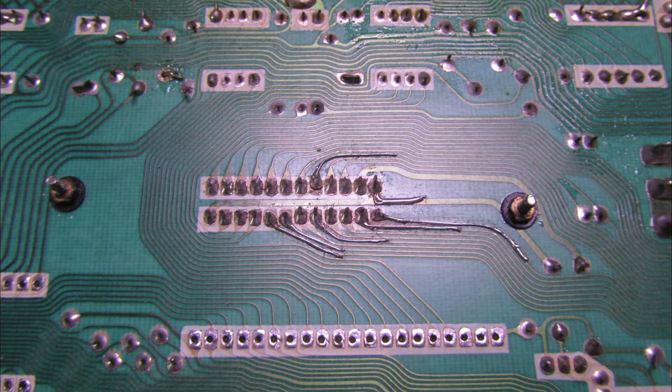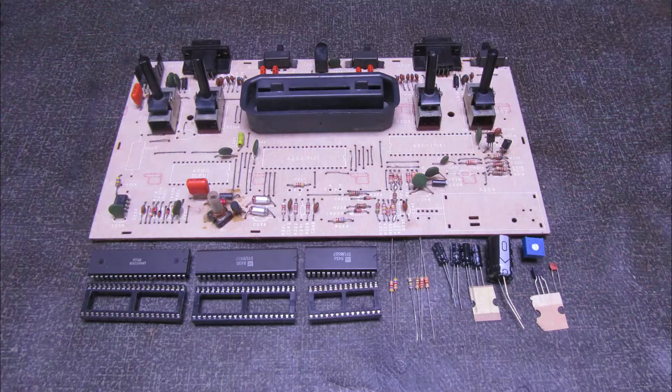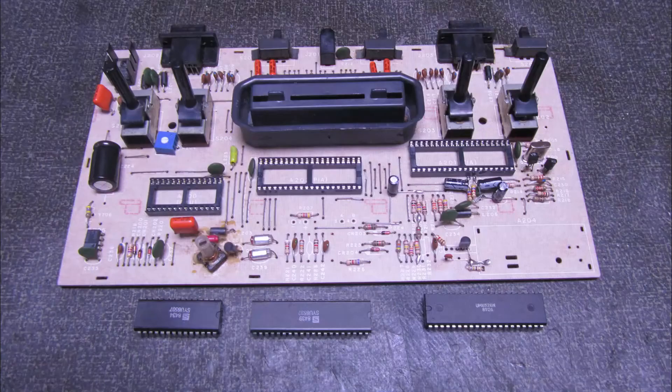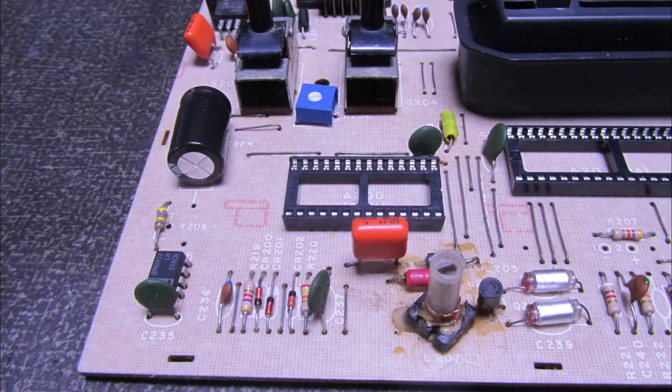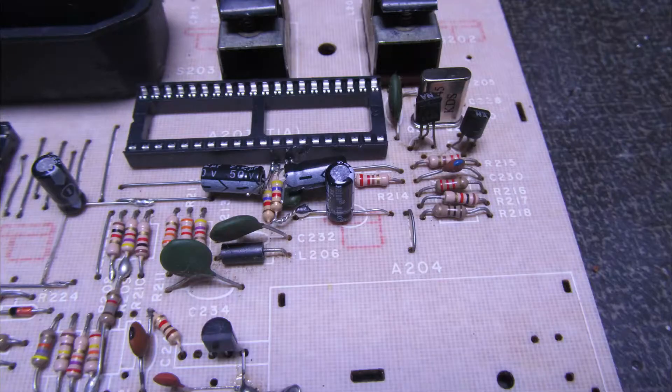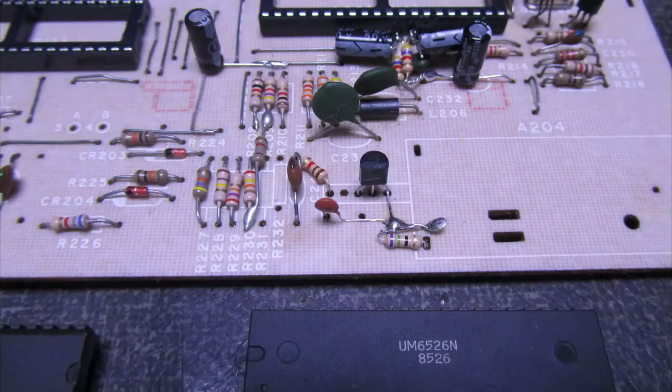I've separated here all the components: new sockets. Unfortunately the three chips were in good condition — I don't need to substitute any — so we'll replace the capacitors and install a new trim pot. I've done all the assembly in this phase and performed measurements to verify everything: checking the correct voltage, the 5V supply, the color voltage, and the 10V for the TIA chip. Everything is correct. We have the three chips in detail — here I'm showing the audio output, and here's the video section with the filter.